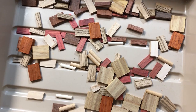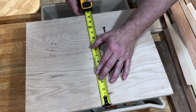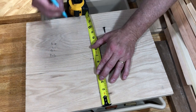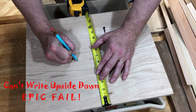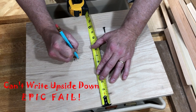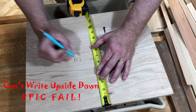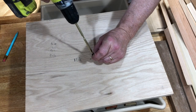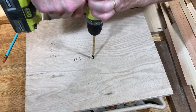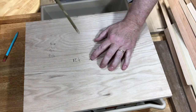As I played around with that aluminum form, it was too wobbly — it never really held a perfect circle. So I took another piece of scrap plywood and I'm going to cut out a 13 and a quarter inch circle out of it to help support that aluminum form. We'll put a little screw in as a guide in the center and take it over to our jig on the bandsaw to help us cut that circle.